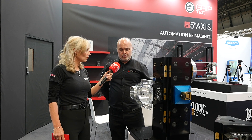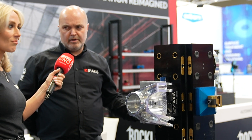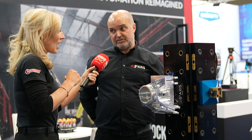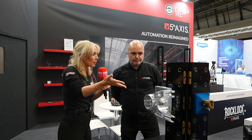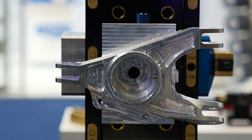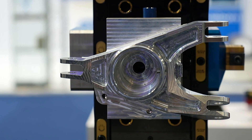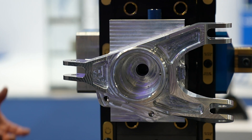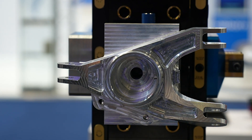By having this and giving you total flexibility, you've got various sizes. This, for instance, is a large tombstone for a horizontal machining centre — available in a 400 pallet or a 500 pallet. This is a brand new product that's going to be really popular here in the UK. It saves an engineer making his own, and you can see there's very little wastage of the material. The dovetail system, which is unique from the dovetail fixtures we started with, has been rolled out right across the products for more security in holding components.